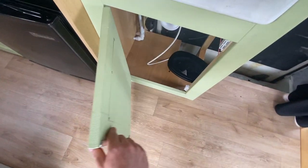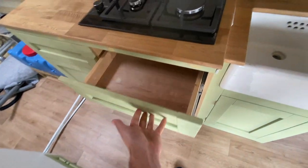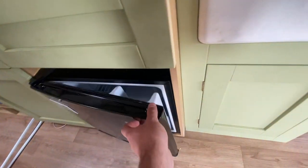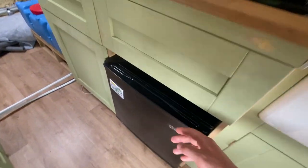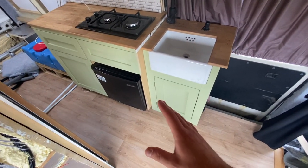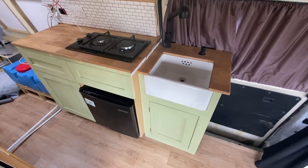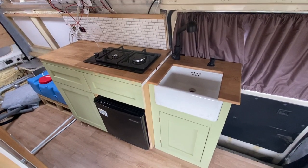Let's have a closer look. This cupboard door - I've just put a couple of magnetic catches on there to keep the door closed. There's a cup drawer here and another drawer here. That cupboard down there - I've changed the fridge door round so it opens from this side now. We really like the green colour, but unfortunately this chalk finish isn't very durable. Even just putting these drawer fronts on, I've marked it in loads of places - it scratches really easily. You can coat chalk paint in wax, but if I ever want to change the colour in the future it's going to be a nightmare to paint over the wax. So I'm going to look for a satin wood in this colour instead. I'm still in two minds whether I should paint this green to match the doors or keep it wood - let me know in the comments.